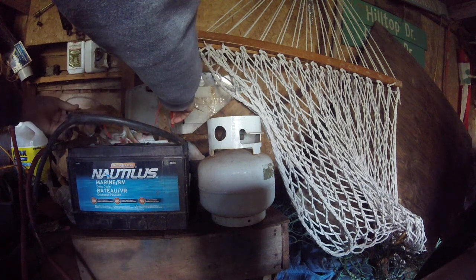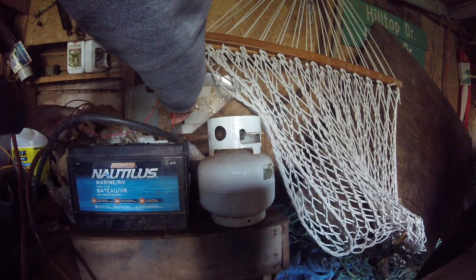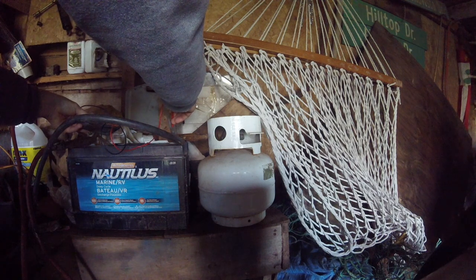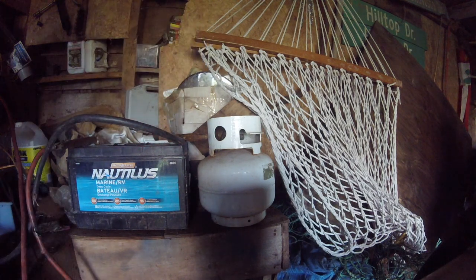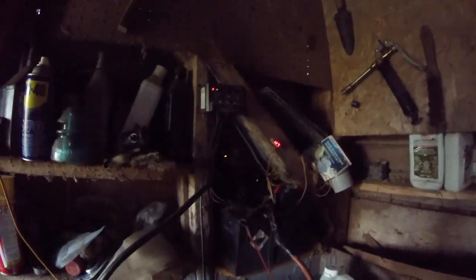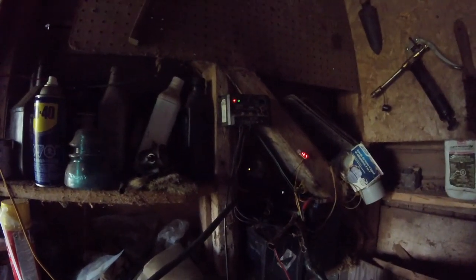It's bouncing around. Voltage DC. 12.4. So it's showing 12.4. It was 12.0. So it is coming up. So that's going to take a couple of days. I'll come back tomorrow and we're going to see where it is, but at least all the batteries together in this system are holding at 12.7. So that's not too bad.